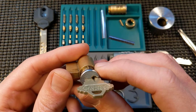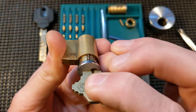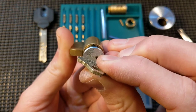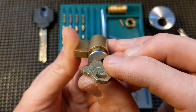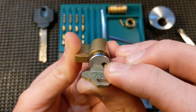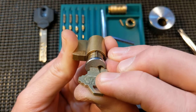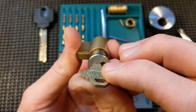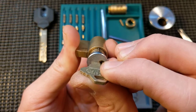If we recall, a traditional sidebar is this piece of metal that runs down the side of the plug and it sits in this channel, this groove. But you can see the face of the groove is kind of at a 45 degree angle, and that matches with the slope face of the sidebar itself. So when you turn — either using the key or with your tensioner — some component of that force is pointed straight down into the plug and it forces the sidebar down.